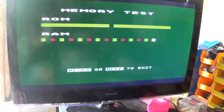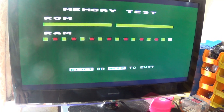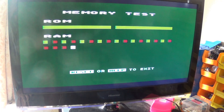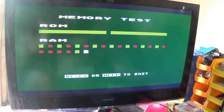Normally it would run through here and get through, but it doesn't get past the RAM test. Otherwise normally it would go through the RAM test and then the sound test and so forth. So it gets this far — you can see there now it's red block after red block after red block. So definitely some RAM issues.